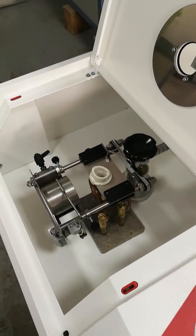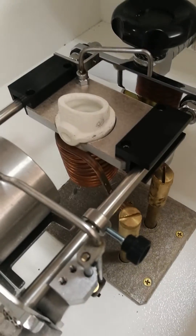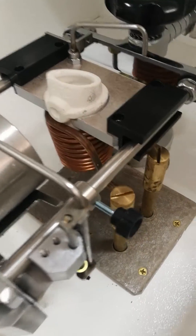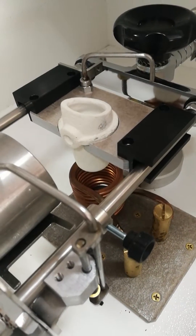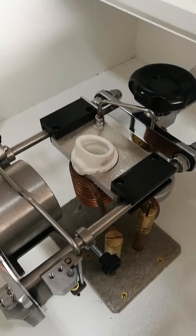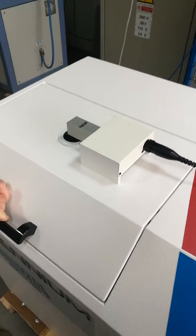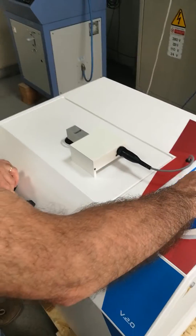The crucible is now in place — we lifted the coil that is now around the crucible. When the spin starts, of course the coil is down and the crucible will go closer to the cylinder again.